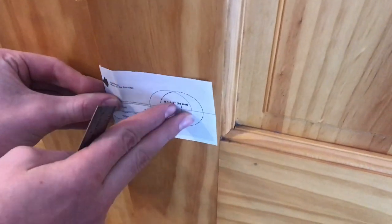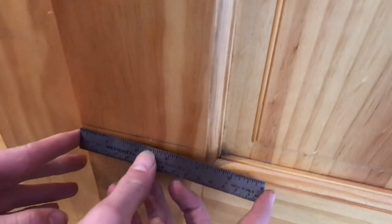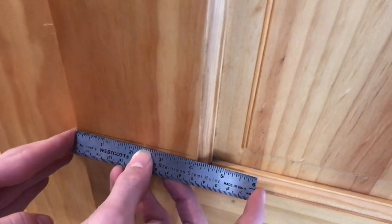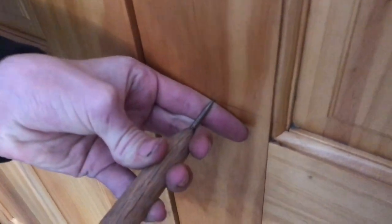But this template has a lot of play in it. What I did is just take a ruler, measured 2 and 3/8 inches, and put my mark right there so I know it's right where I want it to be. I used an awl just to tap in that marking hole so our drill bit has somewhere to lead into.